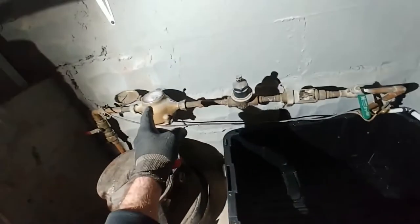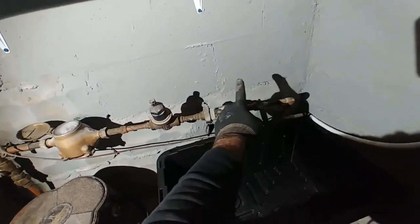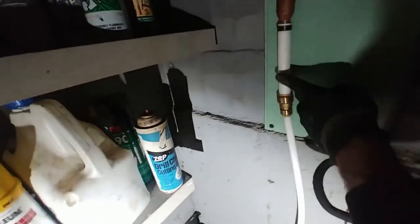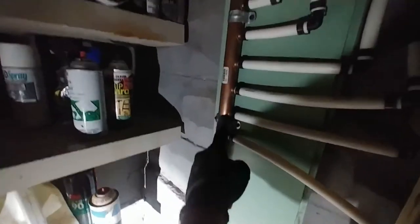So we're going to just replace, I think, this with a 3/4 inch diameter nipple, this with a 3/4 inch diameter nipple, and here we're going to omit this valve and go immediately to PEX, and then we're probably going to put the manifold on the wall, but we're going to essentially keep it 3/4 all the way up to the manifold again, instead of necking it down here in the middle, and clean this all up, and most of these don't go anywhere. And we want, in the end, I want this copper manifold for the bathroom stairs because it's capped, and we're going to use a